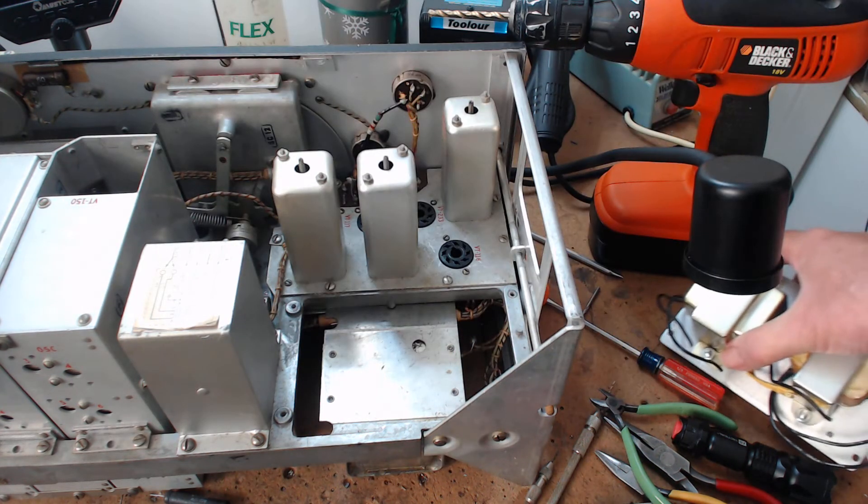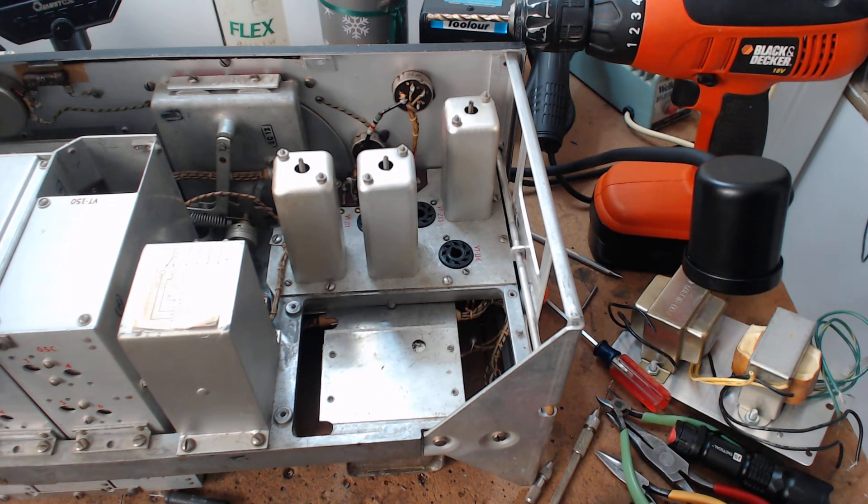I try to keep my radio original. The reason I'm building this the way I am is I can move this power supply between radios. It takes longer but like my command radio one - it unplugs real quick, you can change the power supply from one radio to another in less than 30 seconds. Leave the radio original. Just remember the minus of the high voltage, which should be around 200 volts, doesn't go to ground. If you see any schematic that shows that, avoid it - those are redrawers who never built the circuit.